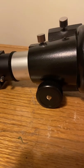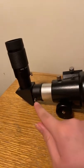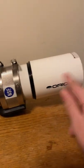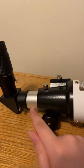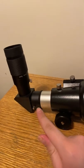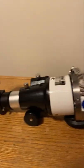Turn the focusing knob left and right until it is fully focused. What's happening is this piece over here has to be at a certain distance between this and the refractive optics. Once the light is bent and reaches its focal point, it will start to unfocus again, and that is why you need to have a correct distance between this and the refractive optics.